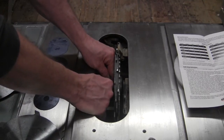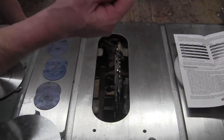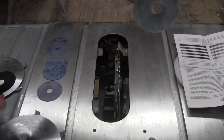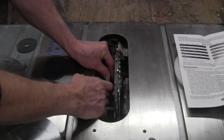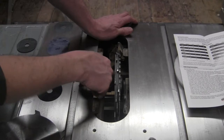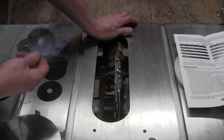What I will do is get some fine-grit sandpaper and just loosen that up a tiny bit — because this really doesn't need to fit precisely or tightly; it's just a spacer. I chipped a tiny bit of metal trying to get it off. Even the thicker 0.2 shim is the same problem. The diameter of the hole is too small to make them easy to come on and off. The blades themselves fit pretty snug too, but I think you want that in the blades so you're not getting any movement up and down. For the shims, I'd just give them a fine bit of sanding — that's probably what I'll do with those.